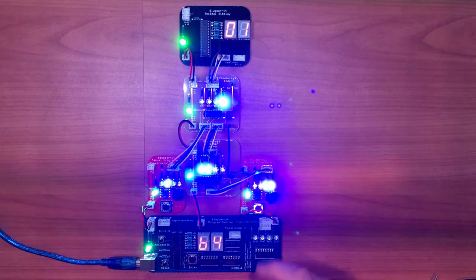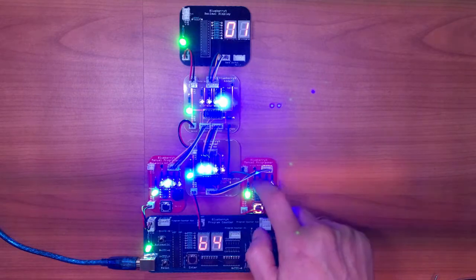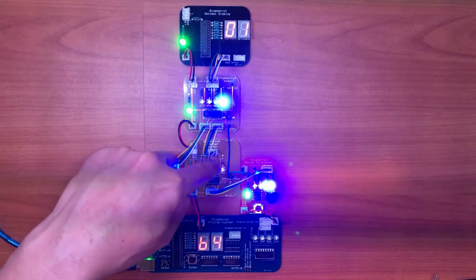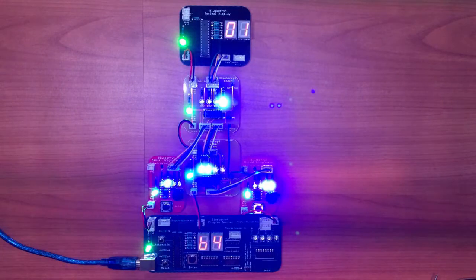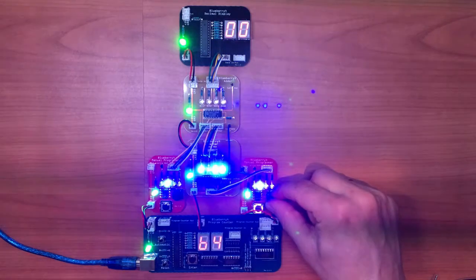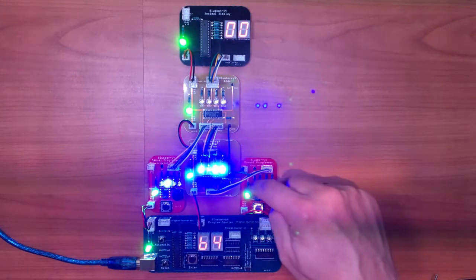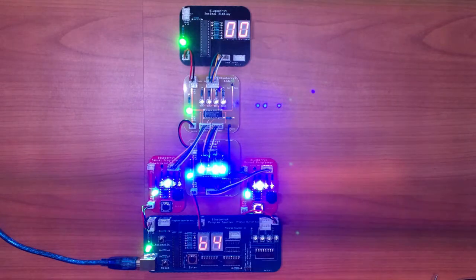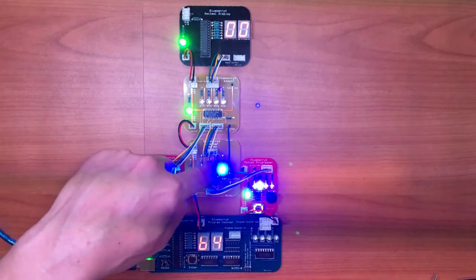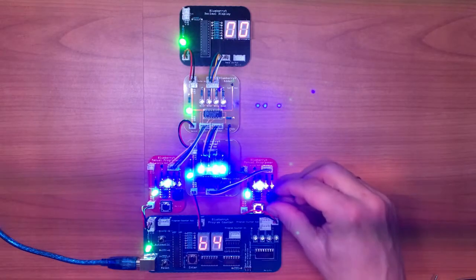What's happening? You see this data piece here, a 0, 0, 1, 1, going through the inverter when it's subtracting is doing something with it. It's turning it into a 1, 1, 0, 0. Okay, so it looks like an opposite. If we put another pattern in, 0, 1, 0, 0 is somehow being converted into a 1, 0, 1, 1. Let's try another one.